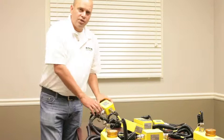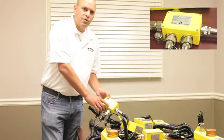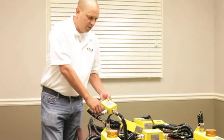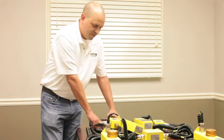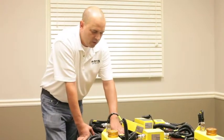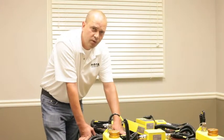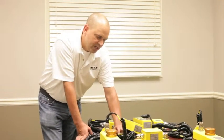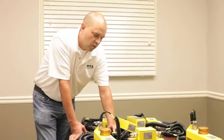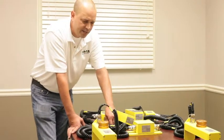On the right side junction box you will see two ports: one that is a grade and one that is a slope. Make sure that you have your grade plugged into the grade and your slope plugged into the slope. The cables that run from the grade to the slope are part number 040202620, but those could also be part numbers ending in 02621 or 02640. They are the same cables, just different sizes.